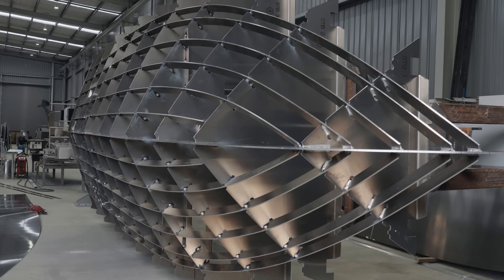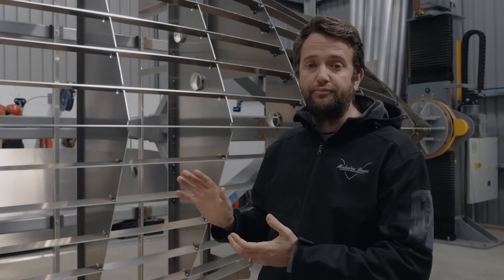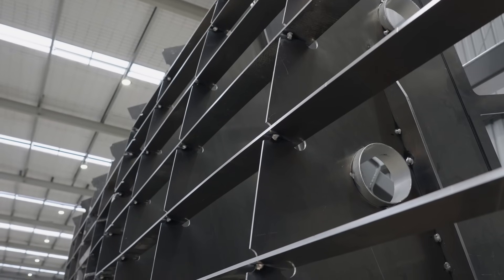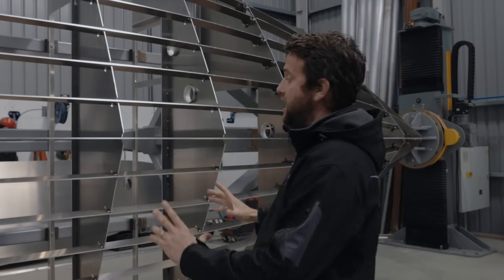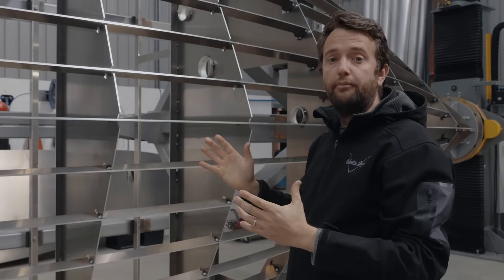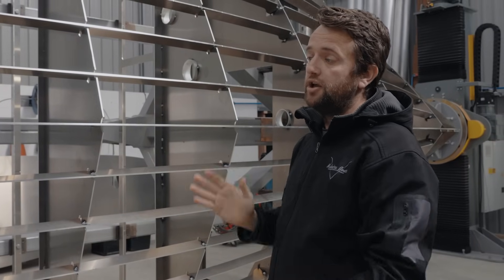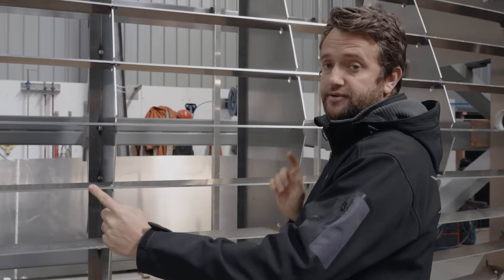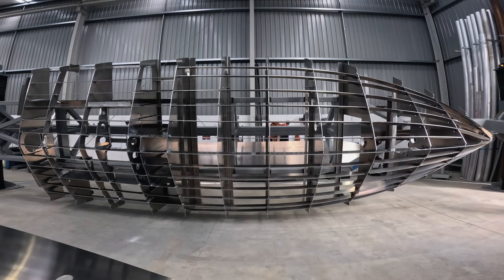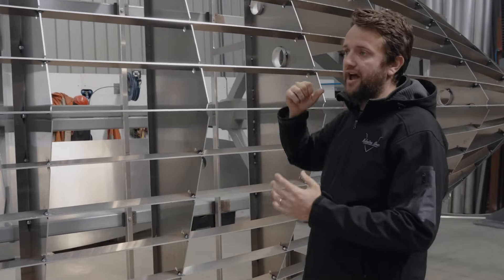One of the common misconceptions in aluminium boats is that they're loud and they pound. The reason some alloy boats do pound is partly because of hull shape, but the other factor is that their hull structure and hull bottom isn't supported well enough. When you have hull structure like this, the biggest panel size in this boat is only about 170mm by 600 to 700mm — just over two feet. Compare that to some boats in the industry that'll have only three frames in a boat this size, with a frame spacing of about 12 feet, leaving a huge panel size that acts like a drum.